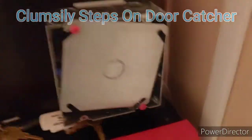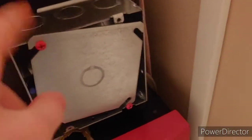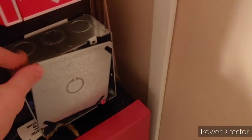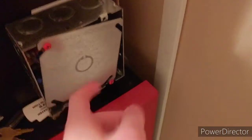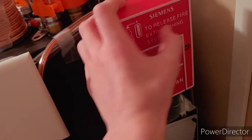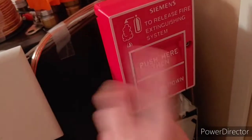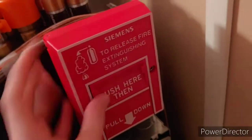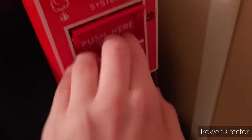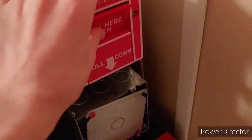If we come over here by the panel, we have my MDL spot with a cover plate. Looks terrible, but it works. And then we have both monitoring modules. And also, for our pull station spot, we have my Siemens agent release dual action — I think it's an MH-501 pull station. Oddly enough, it's actually hard to pull because this doesn't go in as far as like the BG-10.